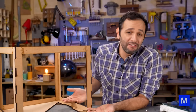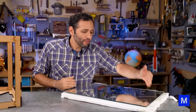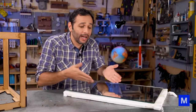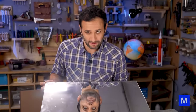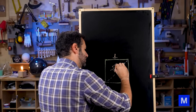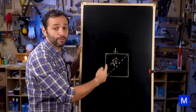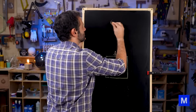There's only one math calculation you need to make to build the box, because you are probably not going to find a mirror that is exactly 60cm on that side. So how do you calculate the box size from the mirror? You will measure the longest side of the rectangle and divide that length by root 2. To be clear where this number comes from: if you have a square with 1m on a side, the diagonal measurement will be 1m times root 2. But our case is the opposite — we already know the diagonal but not the side. So instead of multiplying by root 2, I divide by root 2. My mirror is 60cm and I divide it by root 2. If your calculator doesn't have square root, root 2 is 1.4.